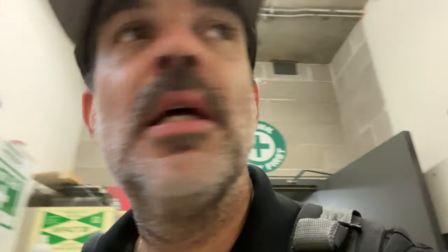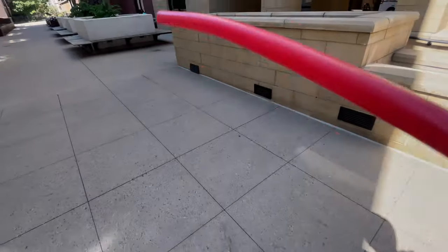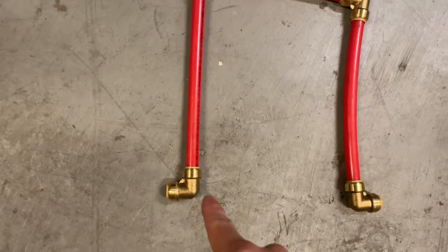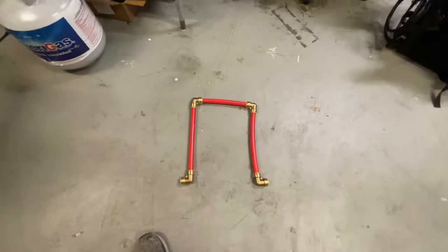So this next one is an Aquatherm. When the air conditioner runs it is still getting hot water to the Aquatherm, which is messing up the cooling. I shut the hot water valve off so it would work through the summer with no issues. My problem is there's water that keeps circulating through the Aquatherm. I checked the Taco pump — it's not running, I even unplugged it and water still runs through. My boss, the area maintenance manager, wants me to install a trap with this PEX. He thinks it's getting siphoned and this might solve it, so I'm going to install this as a way to break that siphoning if that's what's happening. We'll see how that works — if you guys think I'm an idiot for trying this, let me know in the comments.